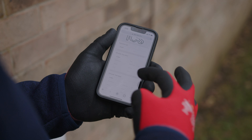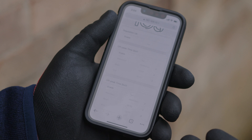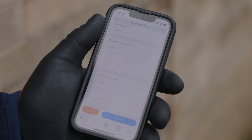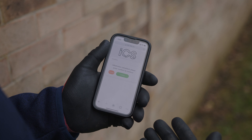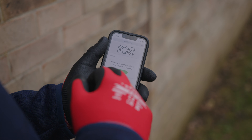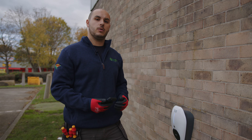In this next step we've got the configuration for the off-peak times, but we've turned these off in this instance as this is a commercial installation and it's not required. You would configure this as per the job if it was needed. Once configured, click the next step which brings you to the complete box, and as you can see initialization is completed. Press confirm to continue, and the charger will then reboot — the commissioning process is complete.